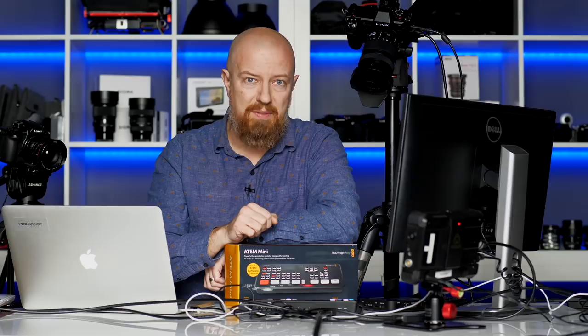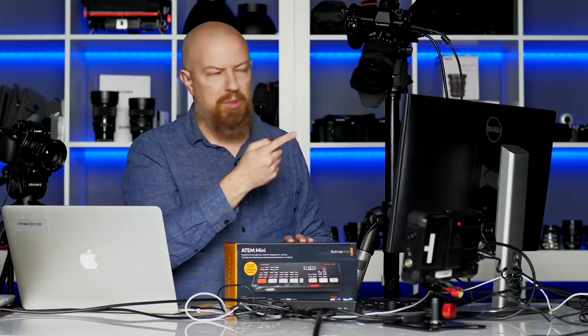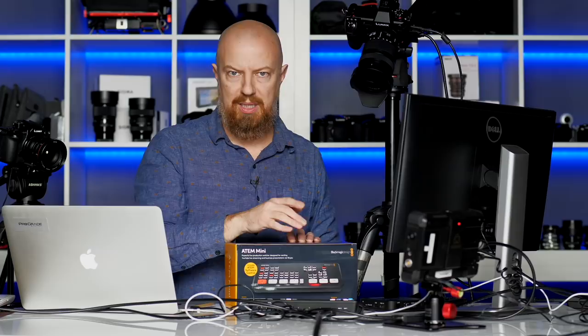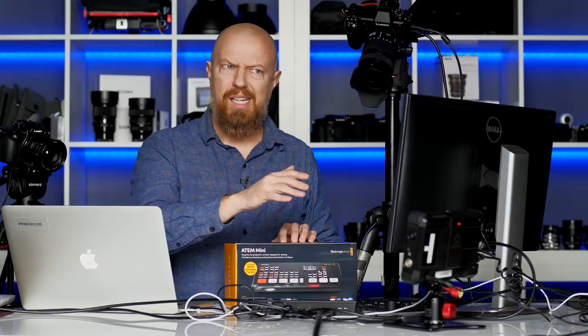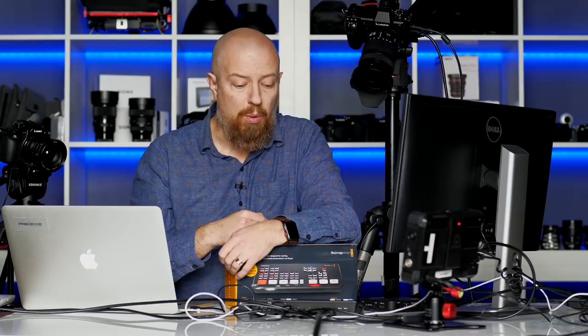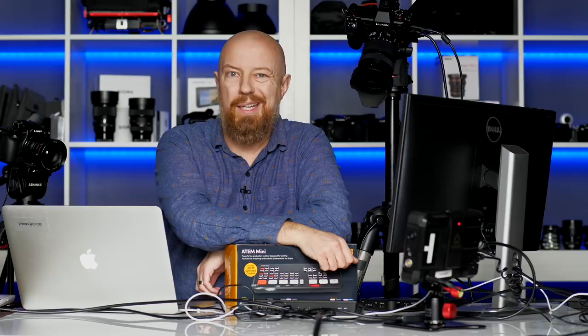What I've got right now is this camera coming in at 1080p 29.97, this camera up here is 1080p 24 — that's true 24p — this one over here is coming in at 59.94, and the computer is set to 25Hz right now. I am outputting a 30p or 29.97 file for recording. So it's completely scaling on input and then on output as well. It's kind of remarkable. Normally scalers are individual things you have to buy and they're quite expensive to get good ones. These are now built in and from what I've seen so far, they look top notch.